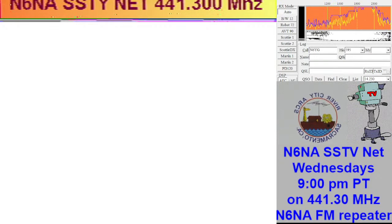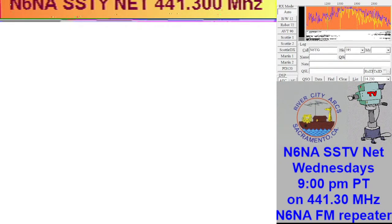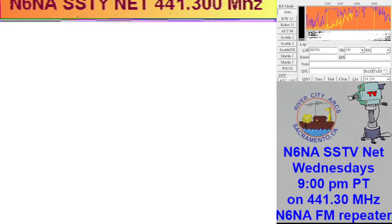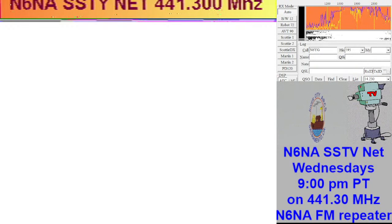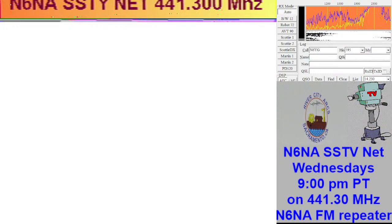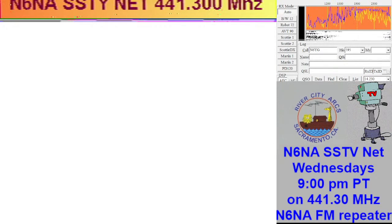In this picture, you are looking at a $10 (well, that's what I paid for it) Advanced Receiver Research 432 GaAs FET preamp that I got off Facebook Marketplace. It's receive only. And of course, a Nano VNA, I'm doing an S21 measurement on it, looking at its peak gain. I believe it was like 21 dB at 437, and something like minus 11 dB at 146.